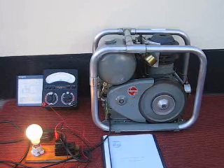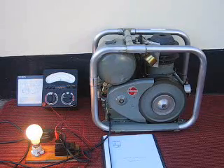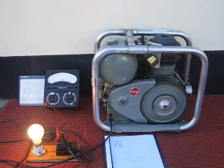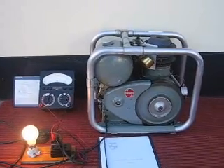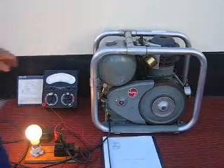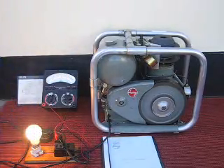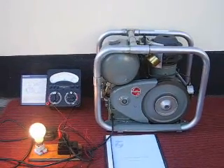Here she is running. She does seem a little noisy — it's because she's in a bit of a confined space, and the camera seems to make things seem a lot louder. On the meter, she's running a 100 watt lamp, and at the moment we've got 270 volts — a little bit more than needed. It needs loading down a bit really, but never mind.